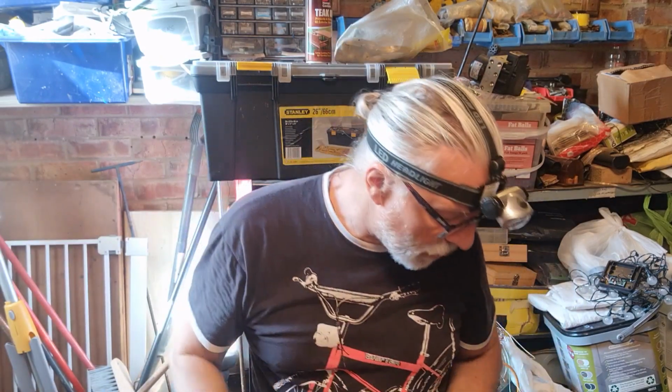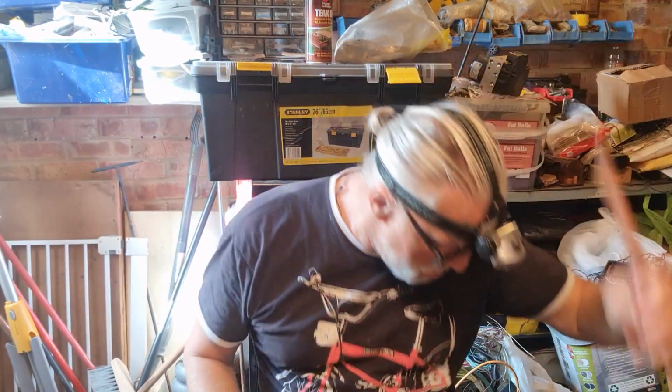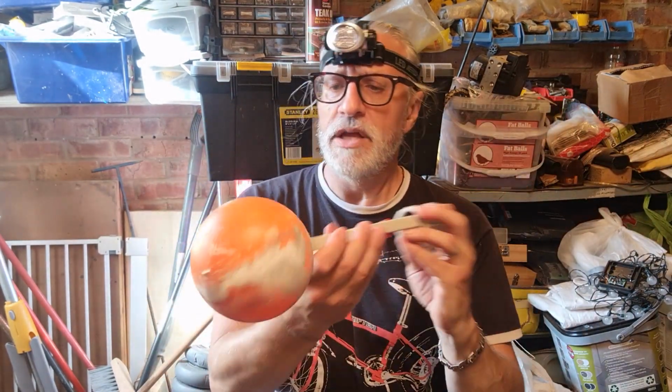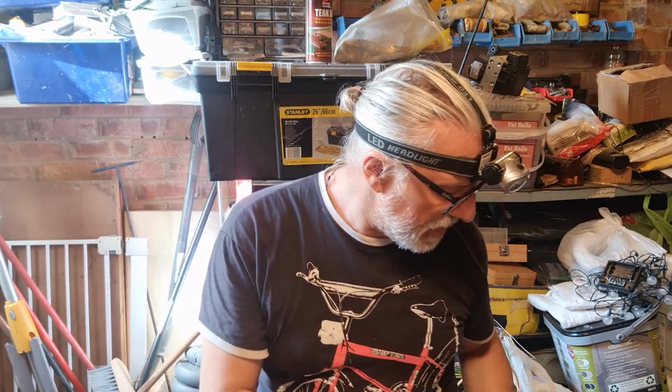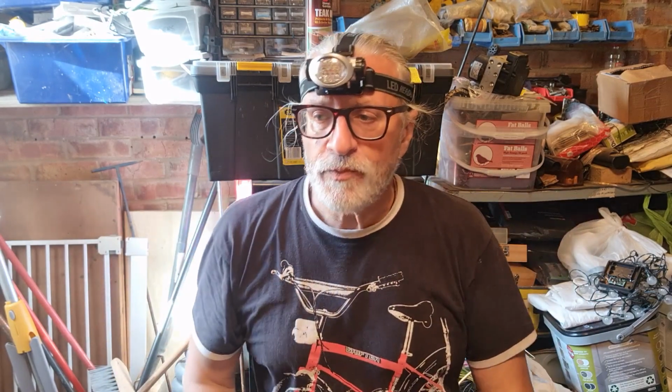So I thought, right, all that's going. So I took out the pipes, took out his crusty old ball valve. It might actually be one of his balls, don't know. Covered in shit, covered in crust. All that was going. I cleaned up the side of the tank because it'd been weeping over the years, so it's all chalk down the side of there. The support bracket was basically hanging on, and so I cleaned it all up. And what you can see, end result, was this picture.